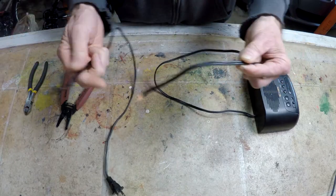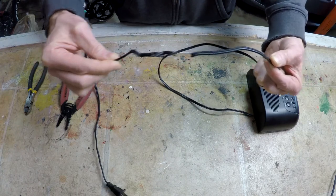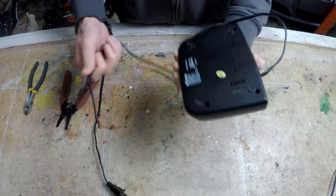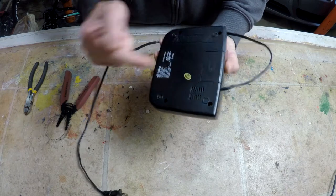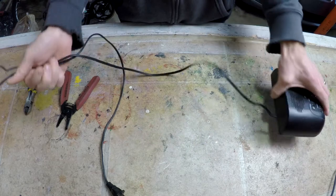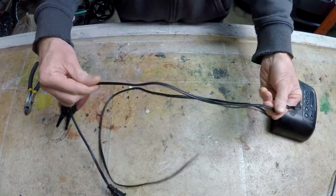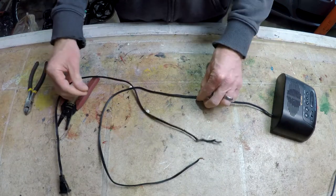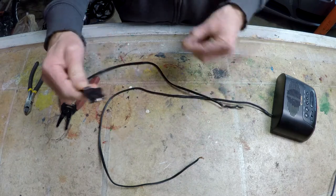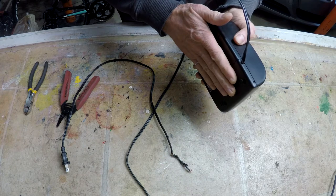That'll enable us, after we cut and clean up the ends, to make sure we are still straight. If there is no lettering, I'd probably try and match the bite marks to see if we could get it right. And if it wasn't obvious from the bite marks, then we're probably opening up the radio and looking inside and figuring out which side is which from there. Alternately, if this damage was longer, we'd probably cut the cord back and then splice a new cord on. Again, making sure we're careful of polarity, or opening it up and just putting a brand new one on right